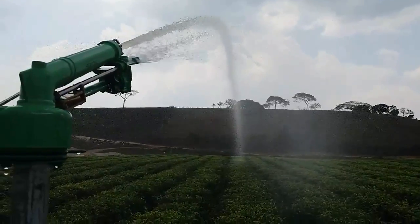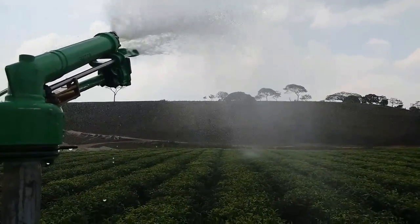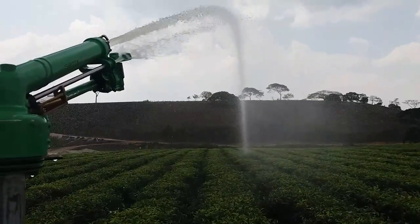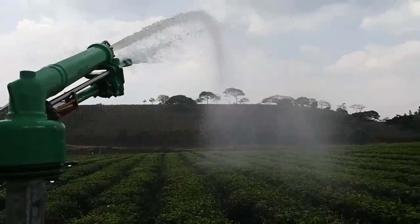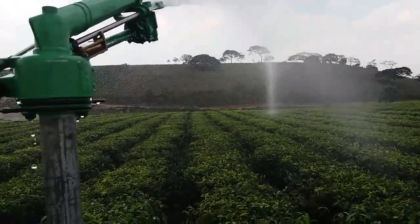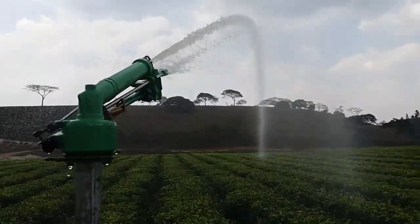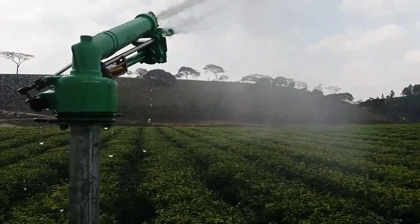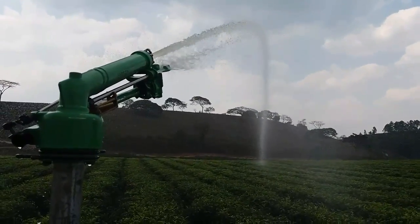From here, at the furthest end you may think that we get a lot of water, but when the sprinkler moves through a circle, the area on the outside is bigger than the area closer to the sprinkler. So with time, after several rotations, you'll see that you have got relatively the same amount of water throughout.